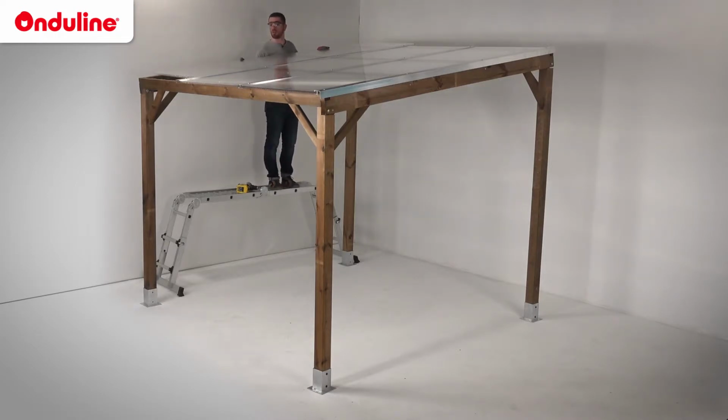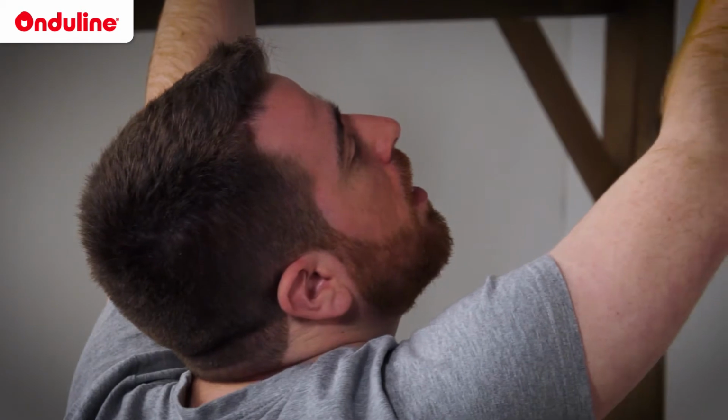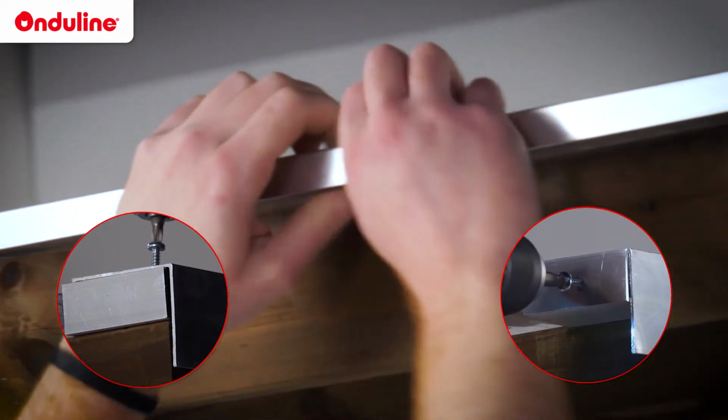Fixations at eave should be put at the end of the installation. Install the shutter tapes at the top and bottom of the slope. Tapes used at the bottom are micro-perforated to enable condensation drain. Then install special U-end profiles and end caps for a best finish.